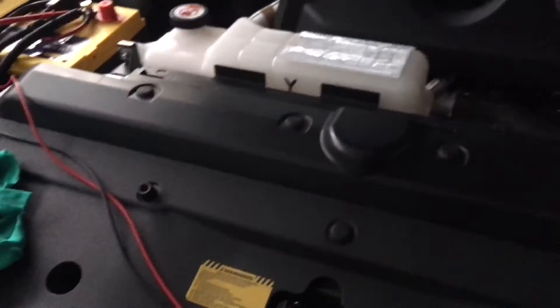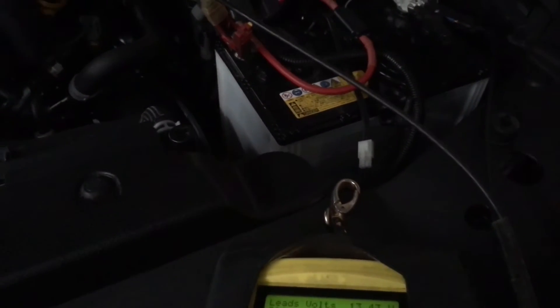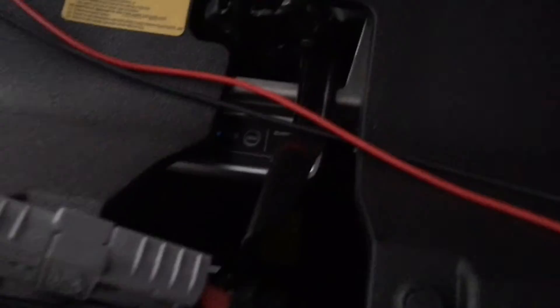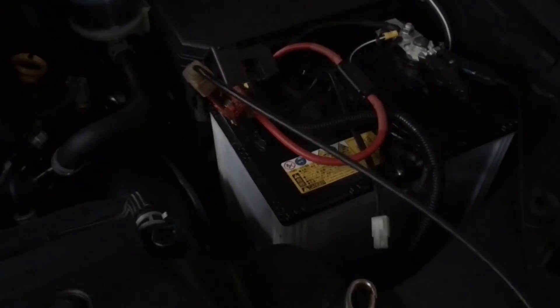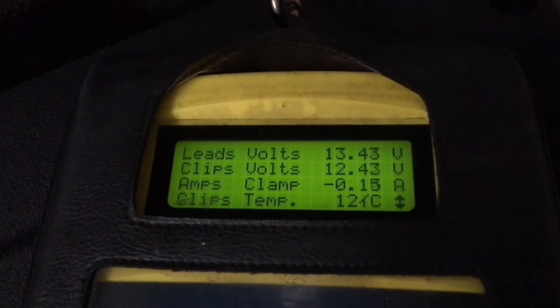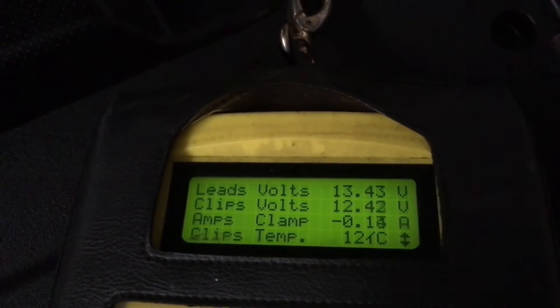That's a negative to this type of setup. When that battery goes flat, I can't with this setup jump-start the vehicle — so we've got a problem. We need to modify this system so we can jump-start or connect our solar using one of those cheaper regulators, because the quality regulator charging that battery doesn't think about this battery.